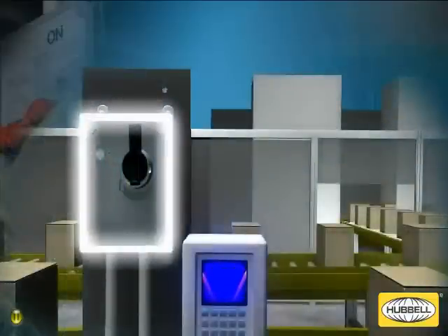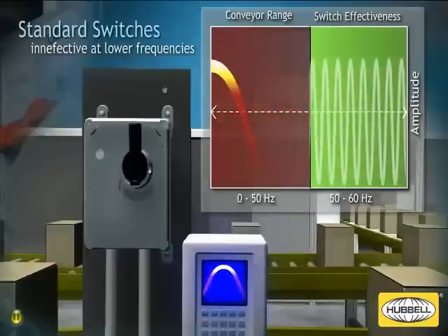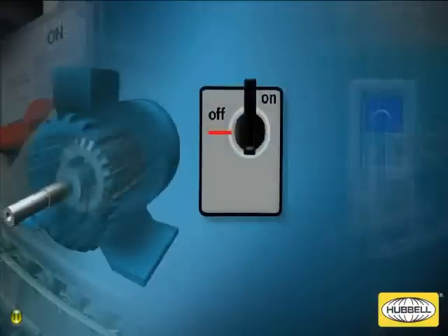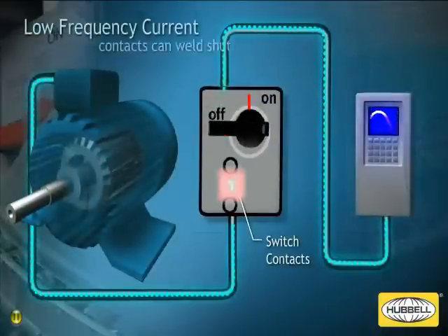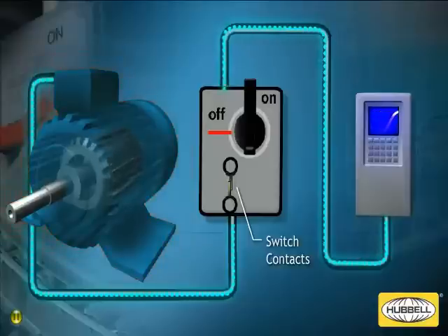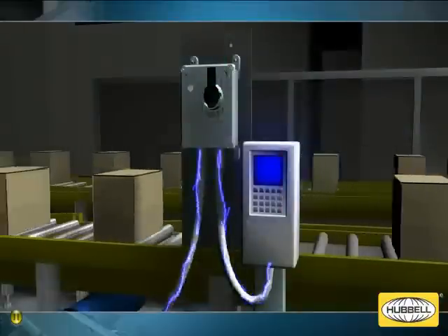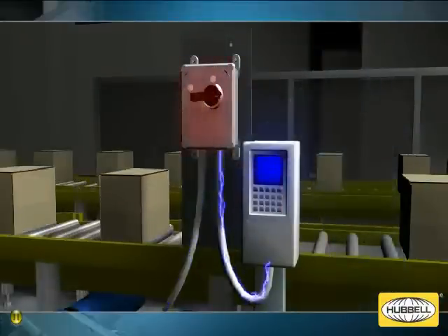Using a standard disconnect switch between your VFD and motor loads has several inherent problems. VFD drive systems produce frequencies outside of the operating range of a standard switch. Interrupting and reconnecting power from the VFD to an active drive motor with a disconnect switch can potentially cause the switch contacts to weld shut. This can prevent the switch from properly and safely cutting off power, which could result in risk of injury to personnel. In addition, if a disconnect switch is turned off while the drive is operating, power will be removed from the motor. However, the drive will continue to supply power to the disconnect switch. This condition can damage the VFD output devices, causing downtime and expensive repairs.